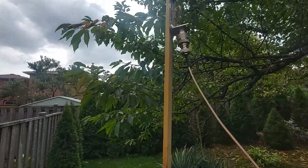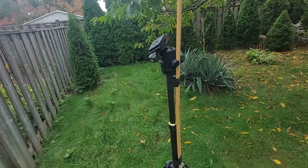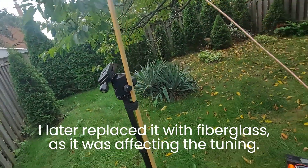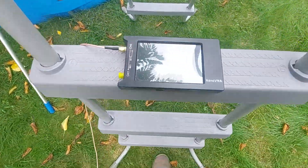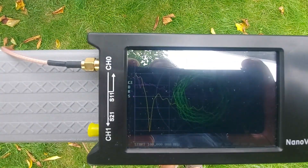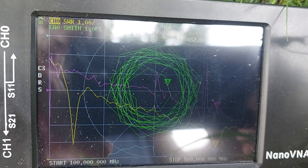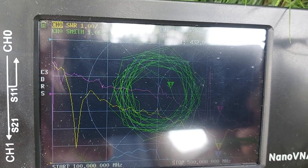Here is the antenna going about two meters above the ground. I have a tripod and I used tape to attach the antenna to a wooden dowel, then a cable goes to the analyzer. I'll take a separate video to show you the results. You can see two dips - the first dip is around 144 megahertz.